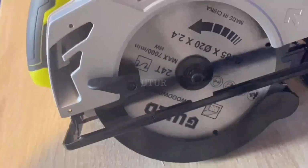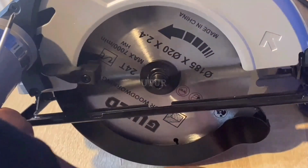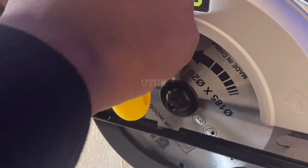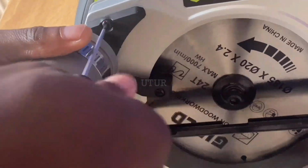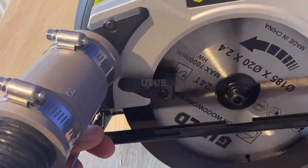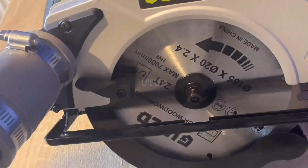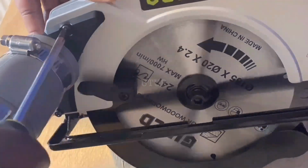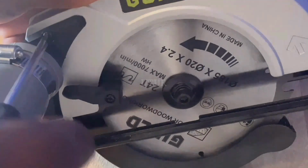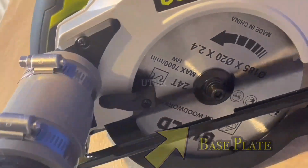Adjust the mechanical fastener appropriately until you get a tight fit on the vacuum adapter. Once the hose and the vacuum adapter have been adequately secured onto the coupling, then you install the vacuum adapter with two screws onto the circular saw, just like I've done here, onto the fixed guard. So we have fastened the vacuum adapter onto the dust extraction outlet, onto the latches, onto the fixed guard with two screws. And prior to this, we connected a suitable vacuum hose directly to the adapter.